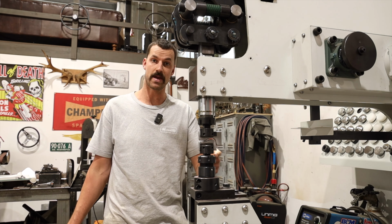So it's not going to be probably a full weld. Well, it actually will be this bit, and we'll be able to planish it, and then this wheel lip will get shaped and shrunk when we go to make our new inner wheel arches.